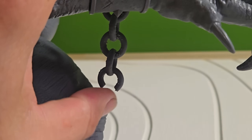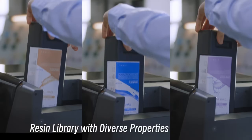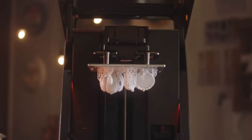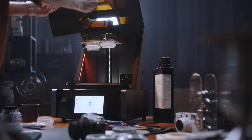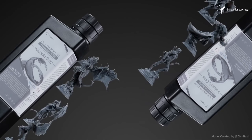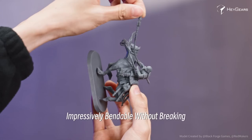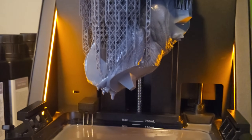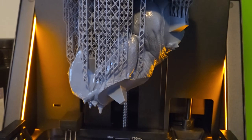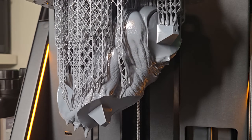That's a great example of why having both printing options gives you so much more creative freedom. Another thing worth mentioning about the Reflex is the material range. It's actually part of Heygear's full material ecosystem. Beyond standard resins, it supports high transparency materials like the PAT-10, as well as wax casting resins, elastic resins, and even ABS-like engineering materials. That opens a door for creating not just prototypes, but real end-use parts with professional strength and performance. The printer's voxel accuracy stays within 16 microns, and this microscopic precision dramatically enhances realism in fine features like the Rancor teeth and claws.